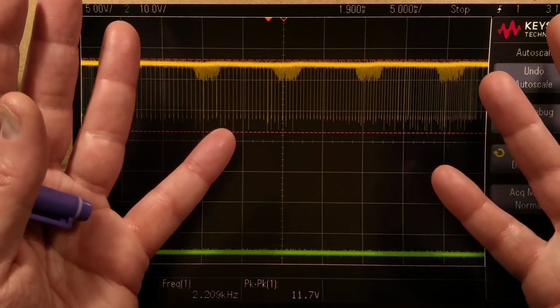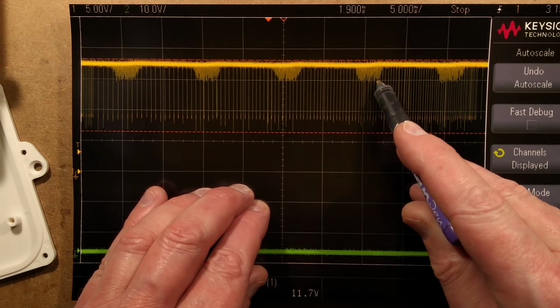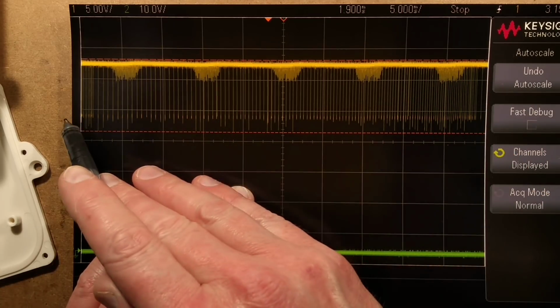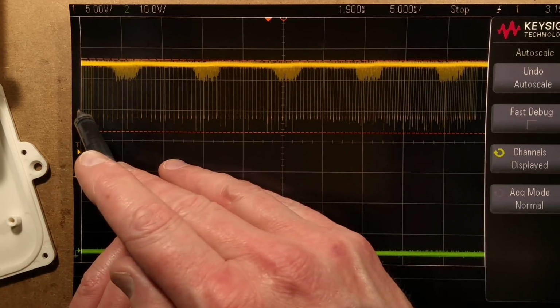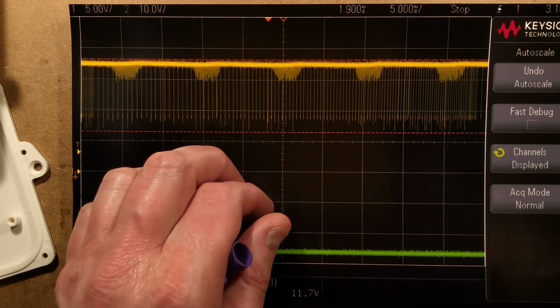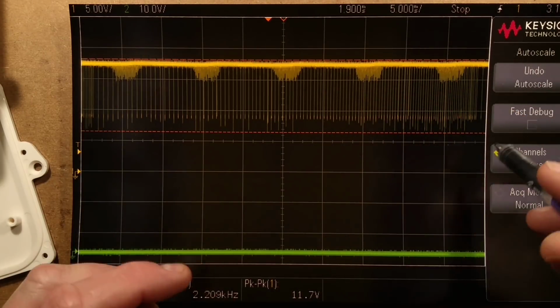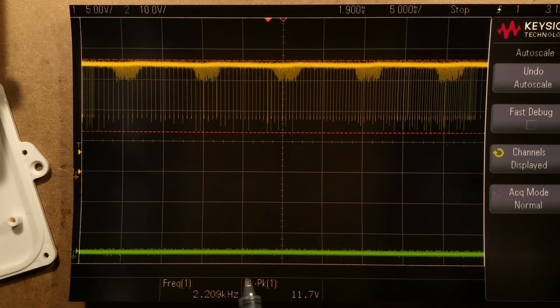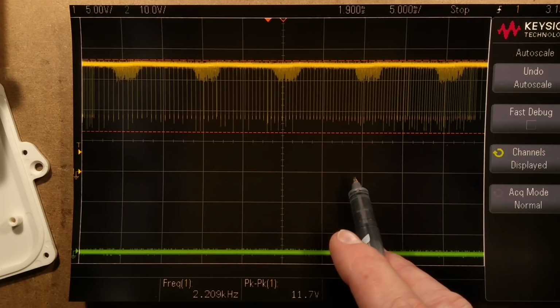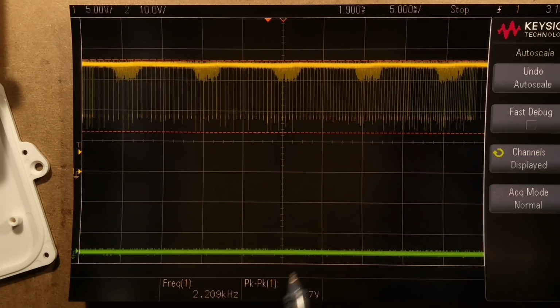It's hard to fit the oscilloscope right under the bench, and to be honest, I was faffing around for a while. These dips here are actually the mains frequency modulation. So this is a sample across the full sweep of what it does. It doesn't actually do a massive frequency range. I worked it out by putting cursors on those points and zooming in. It suggests that the frequency ranges from 1.64 kilohertz to 5.5 kilohertz. So that's the low frequency end sweeping up to the higher frequency 5.5 kilohertz, and then it resets, and it just continually does a ramp. Quite easy to do in software.